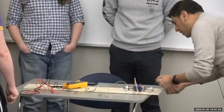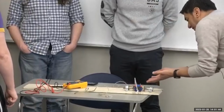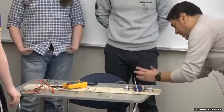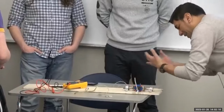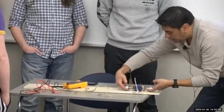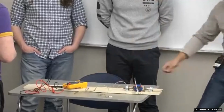And the other thing, ideally, this coil needs to be wrapped around the magnet, and because of the simplicity to build this, it was hard for me to put the coil around the magnet because they have the shaft. So in a real design of a generator, this is more complicated, and in this part of the coil, the head, you don't have much induction. It will not affect the induction. This part here and here will be related to how much voltage you can create, but on this side, you will have no effect. So this is called a coil head, and typically it is moved around the shaft on this side of the generator. But that's the principle. So let's go back now to the slides and let's continue.